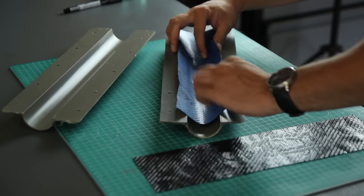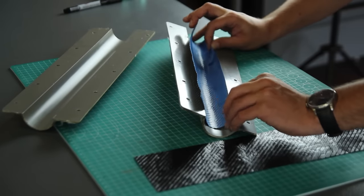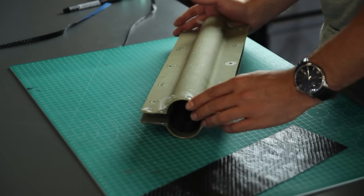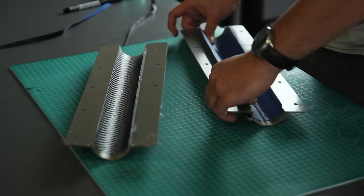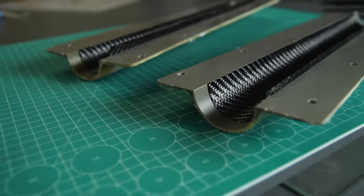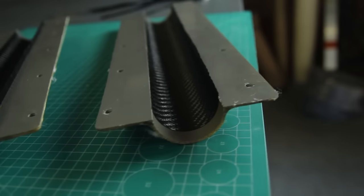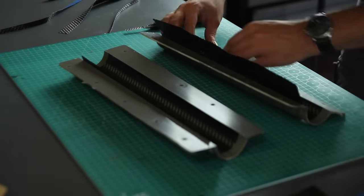The molds were made on an existing tube. I'm using a finishing layer of 200 g/m² out-of-autoclave pre-preg. The first layer is applied, then I cut one edge off on the opposite side — this means one edge will always fit on the inside of the other half. For the layup, the fibers coming out will mostly be on the same side as where you're working from.